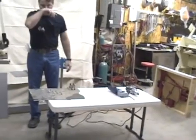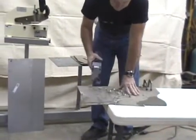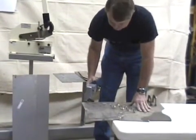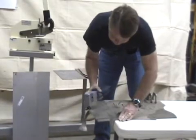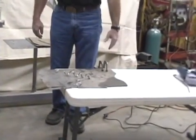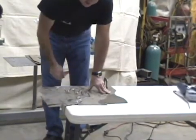We also use the equipment that we sell. One of those is a little electric shear — we sell these and use them here. One important thing when cutting metal is you want to have it clamped or secured so you're not trying to hold it with one hand and cut it with the other. This one will cut 18-gauge mild steel, a little thinner in stainless and galvanized, and as you can see it'll make almost any type of cut — straight, curvy, outside radius.